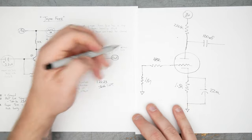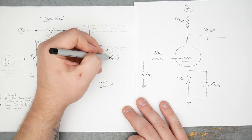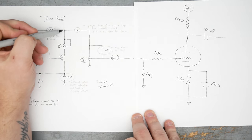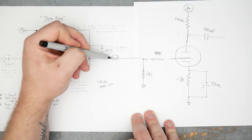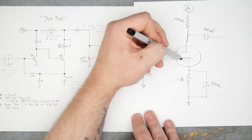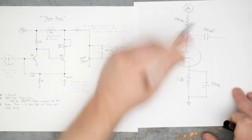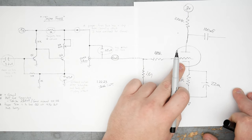Sometimes you'll have a resistor here to ground, like a 1 meg resistor, something like that. But if you plug this pedal into this tube amp, so you're essentially just connecting this boom straight to here like that, you're now sending DC voltage from this point here through the pot, through the jacks, through the cable, all the way here into this stage, sending that however many couple negative volts into the grid of your input tube for your tube amp.